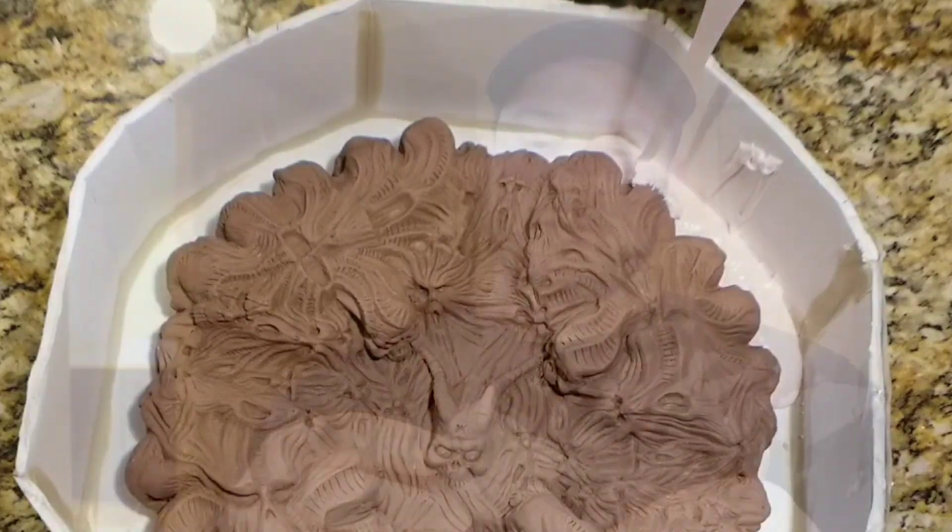That's a brief overview of how I make the cigar holder — basically taking a needle, adding wax on top of it, forming the shapes, and going from there. I know this is a pretty generic overview, but in the near future I'll probably do a time-lapse video of making a cigar holder, very similar to my wolf ashtray video, which I'll link to this one. This raw sculpture is by far not a finished product — it will actually melt with heat, so it's temporary. The goal is to get to a stage where I can create a mold, and from that mold create the actual sculptures. I can do a video on that process at another time if you're interested.